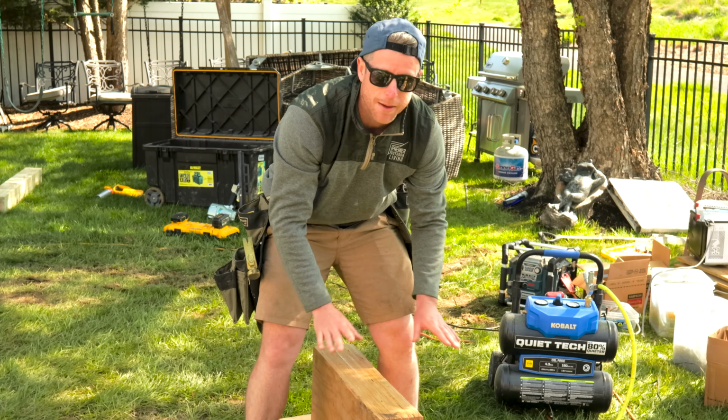I'm sure a lot of people at home are like, oh my god, what are you gonna do with that roof in that corner? Water's gonna go into the house. You guys don't know what you're doing. That's what I'm building, a cricket. It's gonna shed water from that dead spot to the corner of the house. It pretty much creates a valley. Tell me I'm wrong, it's a cricket.